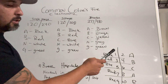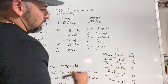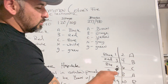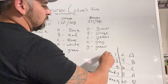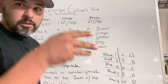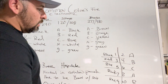The reason we do that is to identify each phase in the panel. A phase is gonna be your 1 and 2 breaker, B phase is gonna be your 3 and 4 breaker, C phase is 5 and 6, and it just keeps going in that same pattern all the way down. So 1 and 2 are black, 3 and 4 red, 5 and 6 blue — A phase, B phase, C phase — because that's the way it's connected inside the panel going down the line.